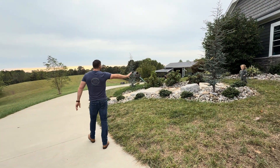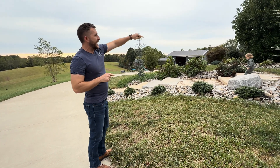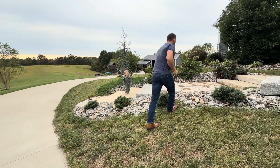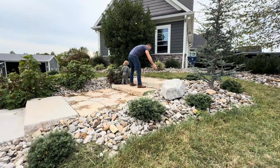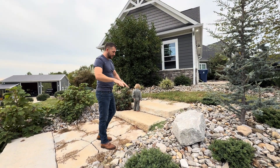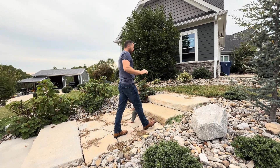As you can see, I had this island in the middle. I was wondering: could it keep itself from going down the steps? As you're going to see in the video, the one time it fell down these stairs, I didn't have a boundary set. You have to set a boundary. If you have a zone like this, set a virtual boundary at the top of your steps so the mower will not accidentally go down. When I mapped all this in a circle, it could still go in and out of those boundaries. If you have a sidewalk or a drop-off or stairs, make sure you're setting a virtual boundary.